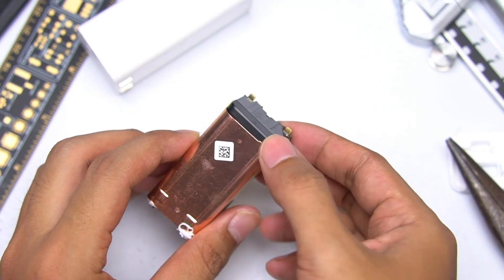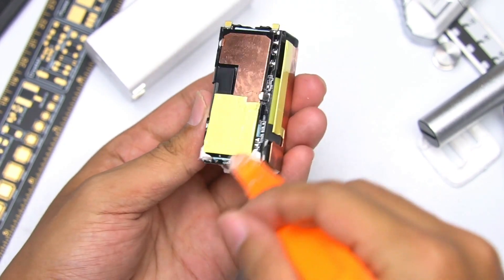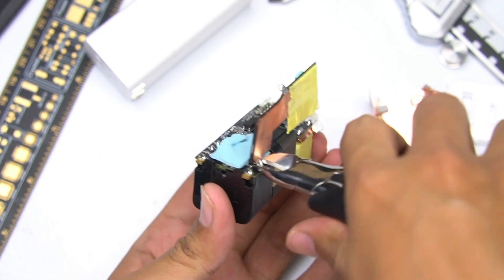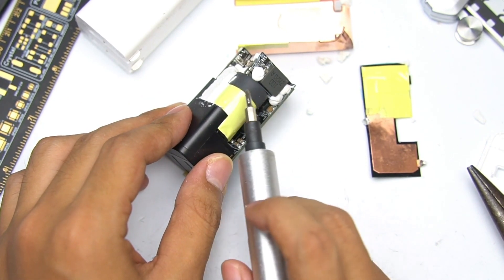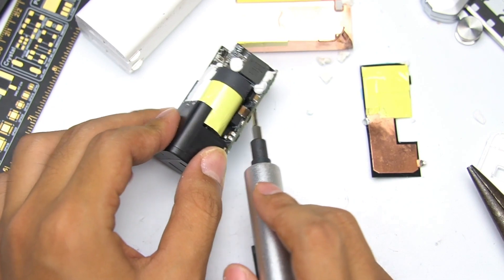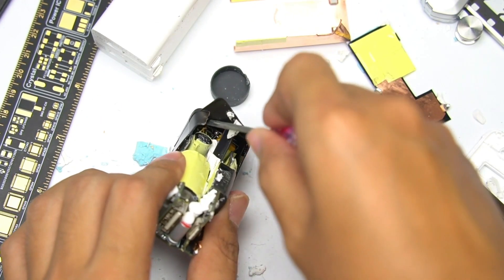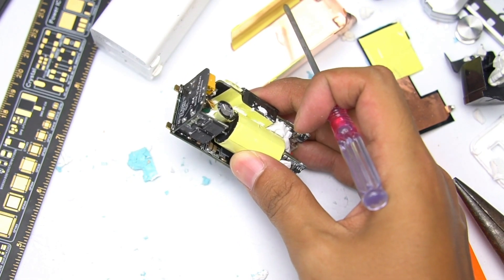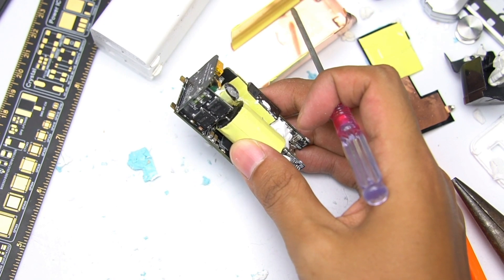The input end is covered with a plastic cover, and the contact adopts ENIG design. There are also heat sinks and isolation plates on the back of the motherboard. The low-voltage side is also wrapped with a layer of insulating tape. Removing the outer heat sink, isolation plate, and thermal pad, the input terminal inside is also covered with a plastic case. The big one in the middle is an electrolytic capacitor for high-voltage filtering. A lot of glue is filled around the components for reinforcement and heat dissipation. There are also two small boards welded vertically at the input end, where the AC input filter and rectifier circuit are located. Xiaomi welded components through multiple small boards to increase space utilization and achieve high-density design.